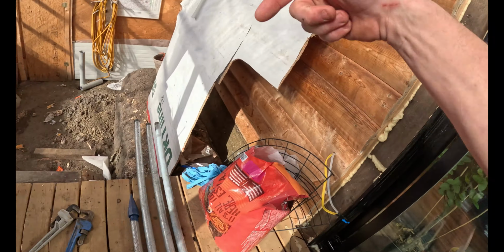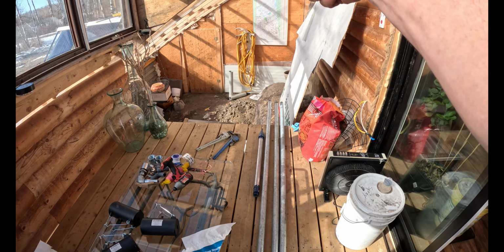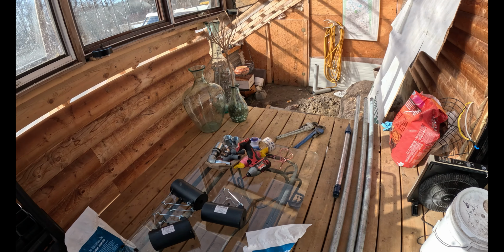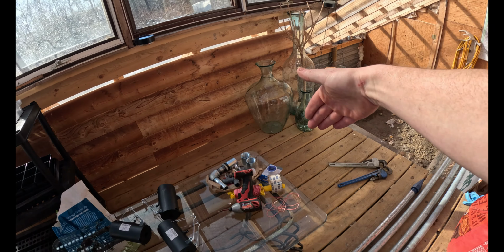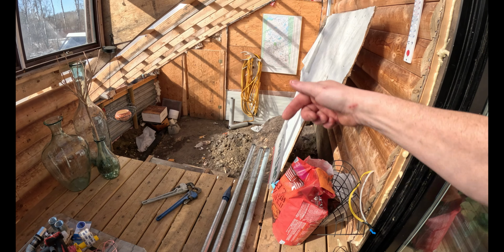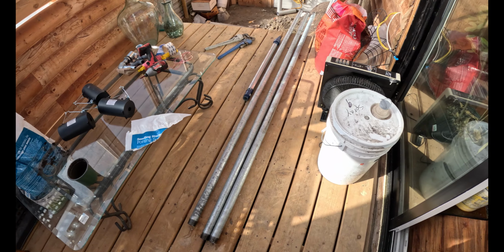We're going to be installing this sand point here into that casing. And so we're going to have to use some Teflon tape, some pipe wrenches, a rope, lower this in there, kind of pound these. It's 24 feet of pipe here. We're going to have to pound that into the earth, into the casing, sorry.